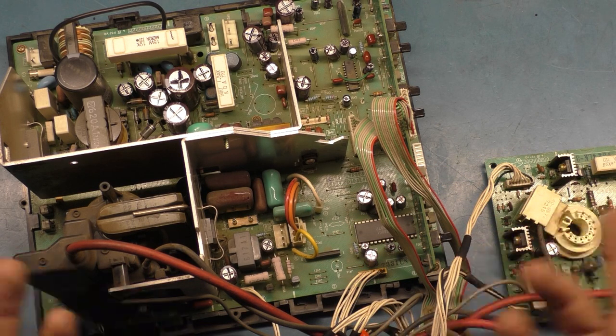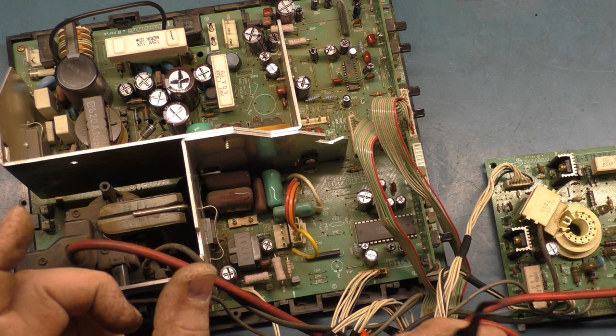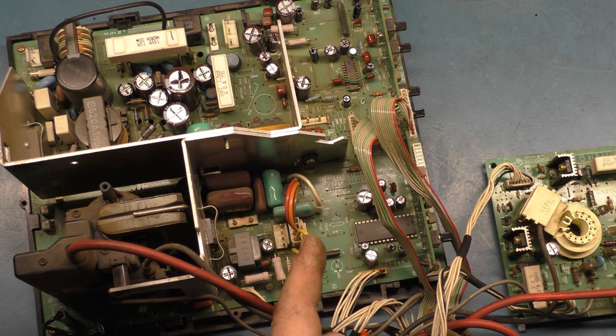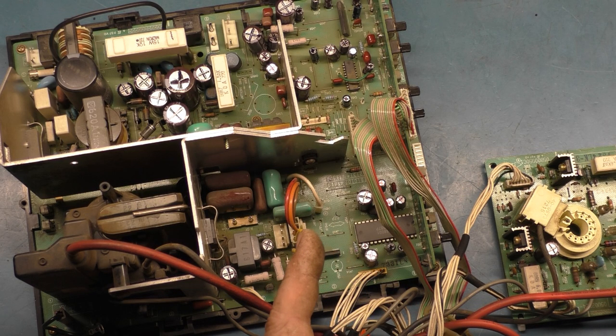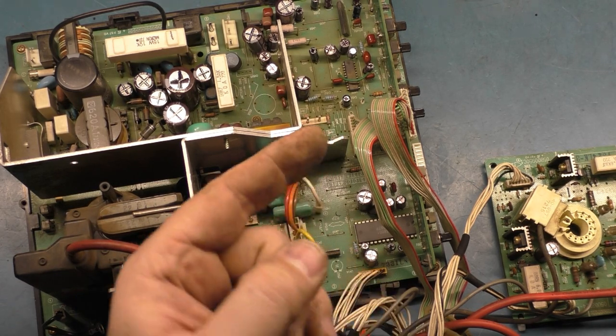Everything was fine. There was no pin cushion issues. There was no problems except for just the black on the left, and it was getting brighter to the right, which we already showed. That was the only issue I could find. But I know that in the past, based off of seeing posts about this from people, that transistor likes to burn up the pads. So when I was doing the reflow, I inspected that, and sure enough,